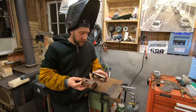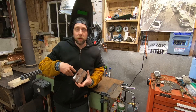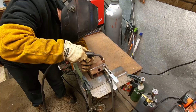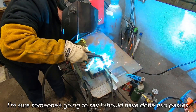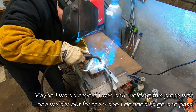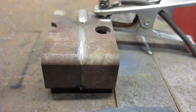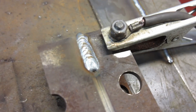I realized that was going to be an ongoing problem, so I just decided to run each machine on 120 volts and do some welding. I got some quarter-inch thick box tubing and I ground the joint down to a V, and we're going to go in and fill it a little bit. You can weld thicker metal, especially if you V it like this to get deeper penetration. It's pretty possible to weld quarter-inch metal with a small machine by chamfering the edges.